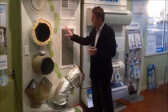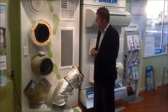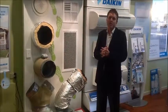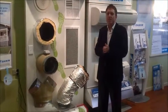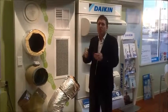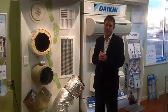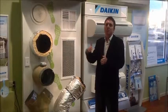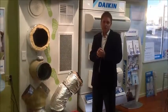The first thing to look at is the size of the return air vent. This particular one is a lot smaller than what we would usually install in a home — it's for display purposes. Generally, for a unit that is 3 horsepower or around 7 kilowatts, we would use one return air vent about 750 by 450 millimetres. Anything above that, we'd look at two grills being 600 by 400 or 450, or one grill of 900 by 500. For larger capacity light commercial units of 18 to 25 kilowatts — 7 to 10 horsepower — you would use two 900 by 500 return air vents.